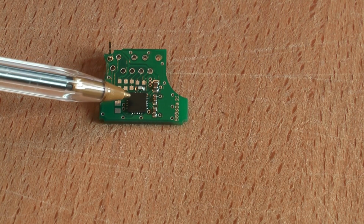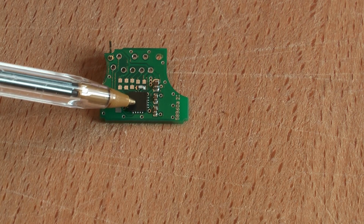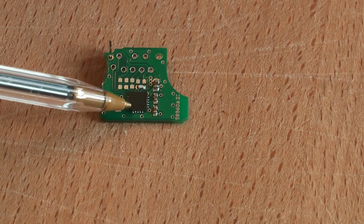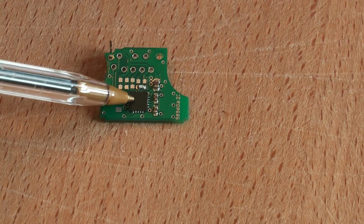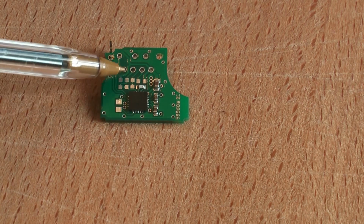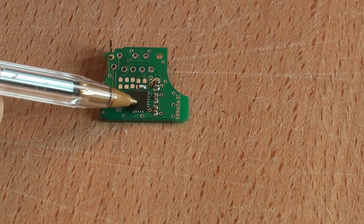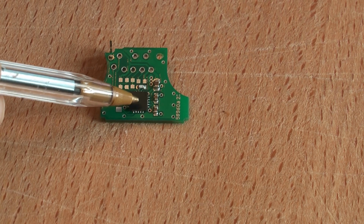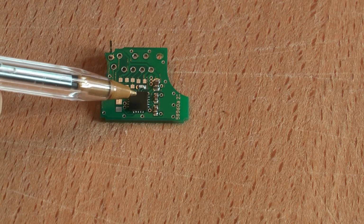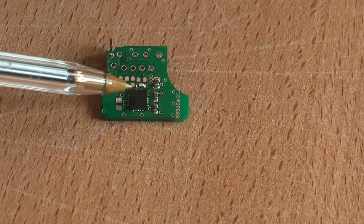One thing for sure that it has inside this chip is the stepper motor drivers. Now that by itself is not enough. We need to create the series of ones and noughts that drive the stepper motor. Therefore it implies it's got an oscillator and some form of logic to derive the ones and noughts to drive the stepper motor. Well, that's all very well, but there doesn't appear to be any sensors anywhere to decide when the actuator has got to its position.